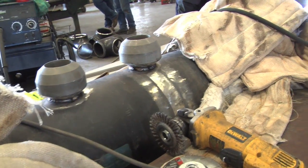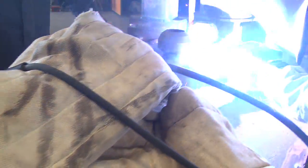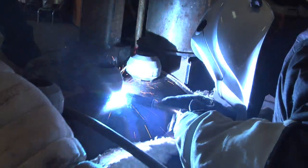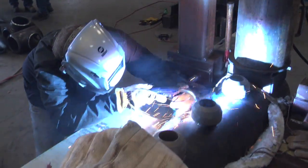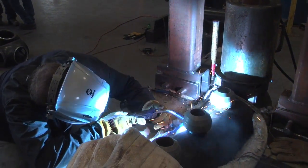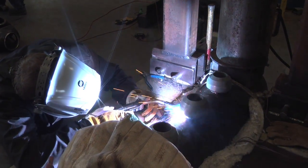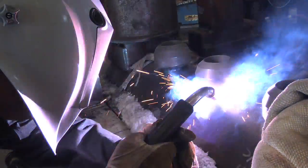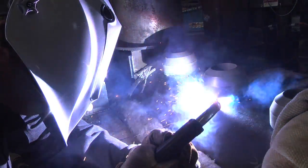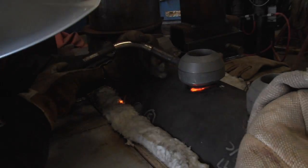The way the holes are cut in the top of the header, we have great fears that it's going to try to fold into itself because of the loss of material. Until we get that material back in there and re-established, we fear that it's going to warp. We think keeping the heat on, as well as pressure, we can keep it from doing that.